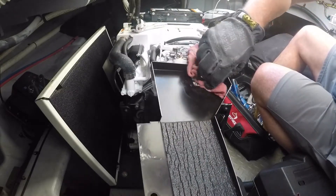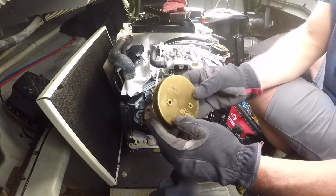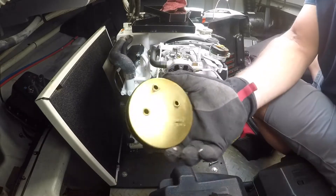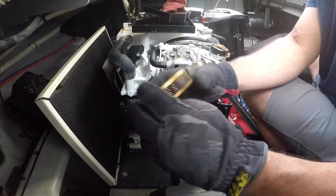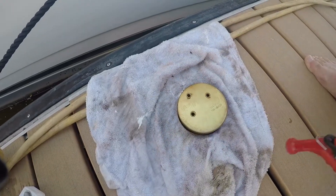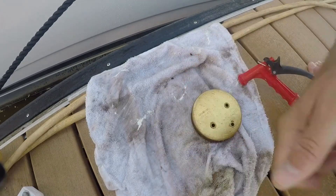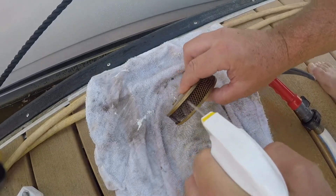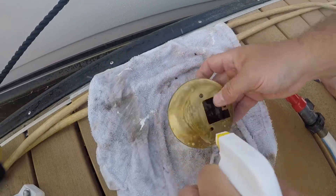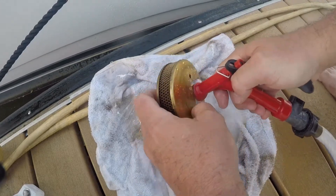Using a shop rag, I just cleaned up any residual oil that was on the housing. My flame arrester was in surprisingly good shape. Flame arresters are different than air filters — you don't need to replace a flame arrester. It can be cleaned with a degreaser, solvent, air pressure, or even soap and water. It's made entirely of metal or brass, which doesn't rust. So spray the flame arrester liberally, scrub it if you wish, and I rinsed it out with water to get a little solvent out.